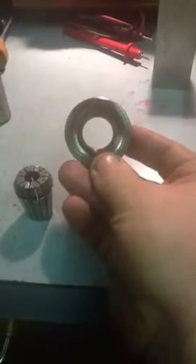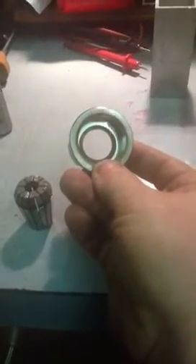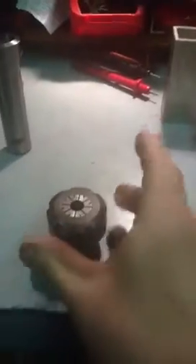If you look down into that closure nut, you'll see there's an eccentric ring machined into the holder itself. The trick is to clip the collet into the nut first, like so. You'll see how that collet is now held securely in the nut. You then take it to your tool holder, and the way I do it — this isn't necessarily the correct way, but this is the way I've found easiest — is to put it in and just tighten it down finger tight.